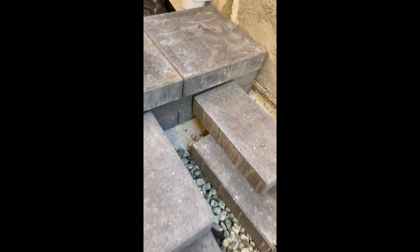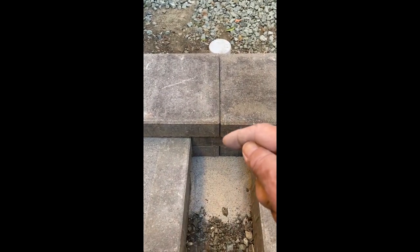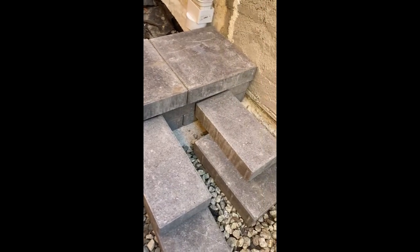I've got the first three rows in place except for the ones I have to cut with my masonry saw. I'll do that tomorrow — I don't want to get all messy tonight. The crazy thing is with this adhesive the blocks were slowly sliding down, so I put some of my excess blocks here as ballast to hold it in place until the adhesive dries. So, to be continued tomorrow.